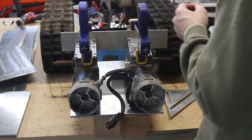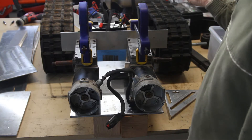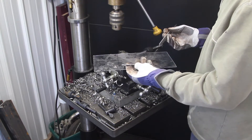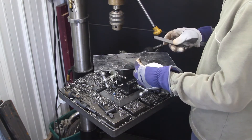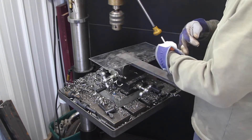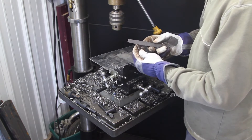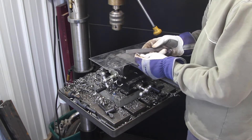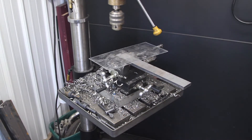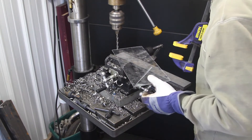This becomes the template. I'll drill the holes, put the bolts in, and if they all fit well the template is good; if not, it's garbage — throw it away and start over. We're drilling into plastic with an old 5/16 drill bit that's probably dull. Drilling into plastic can be pretty scary business — you can crack it, chip it, the piece can go flying. So I'm going to try a trick I saw on YouTube: dull the end of the drill bit using a sander to make basically a zero-rake bit.